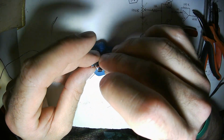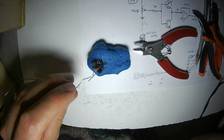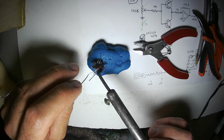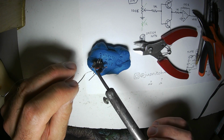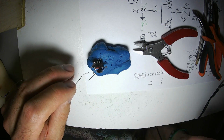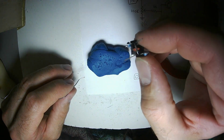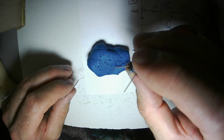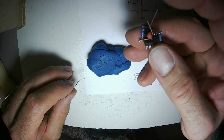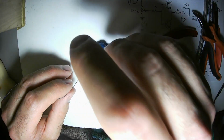Alright. Let me solder these and then I will go do my bed check. Alright. When you're soldering transistor legs, transistor pins, be aware that sometimes they take a minute to get nice and wet from the solder. But that looks good. In all my circuits that have had mysterious failures, most of the mysterious failures are because transistor legs kind of came unconnected. Okay, be right back.